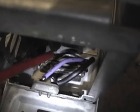So what I noticed is that the AC power wire had shorted to that high voltage donut right about in here. There was a nasty burn in the insulation here, and there was a melted chunk out of the flyback. So I put some heat shrink tubing over the AC wires, and I'm keeping them tucked out of the way. And I should go back and put some type of high voltage insulator on that donut right about there. Luckily there doesn't appear to be any damage because the flyback does seem to be operating correctly.